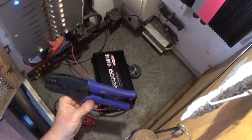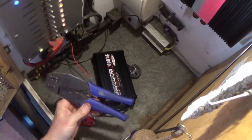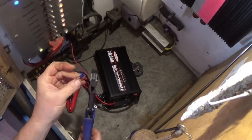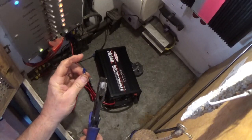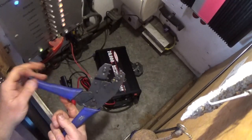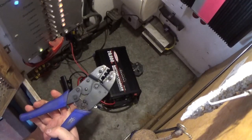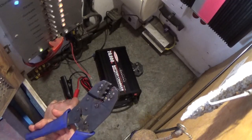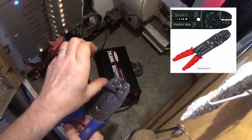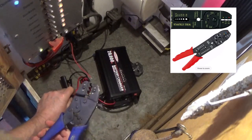Some advice from Triplicate: if you're using these red, blue, and yellow insulated connectors, the colour indicates the size of wire that goes in there. Use ratchet crimp connectors like these - these are Draper and the writing's worn off because I wired up the whole boat with them and I've had no trouble. Whereas the usual red-handle scissor-type ones are rubbish - you will not crimp your crimps properly using those, I promise you.